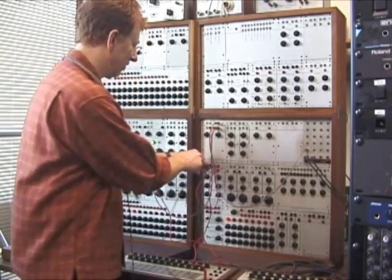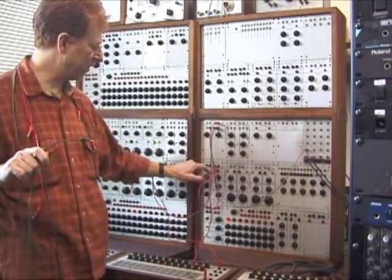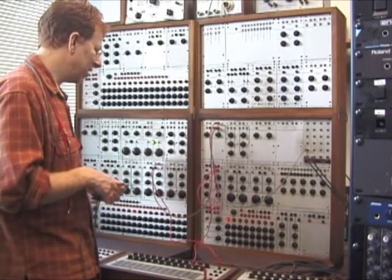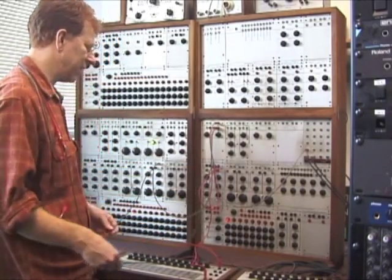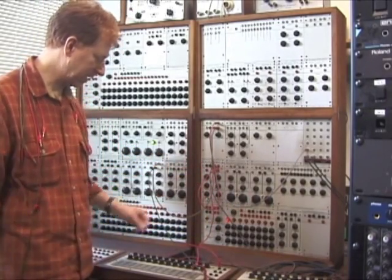So that kind of control is available to you. It's adding the voltages — so it's getting a voltage from here, and then a variable voltage from here, and summing them. We could also not control it from there at all, control it only from the envelope generator. And then, since this is set and it's fixed, each time I trigger it, it's going to sound the same.